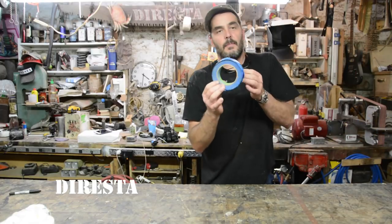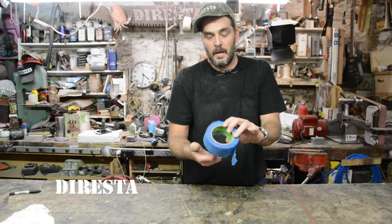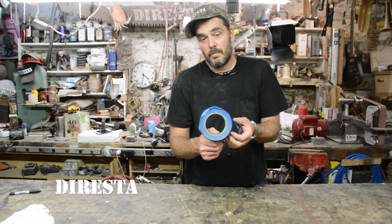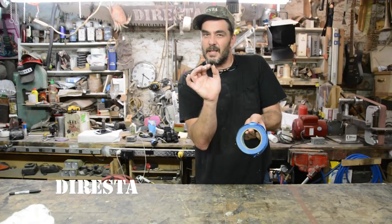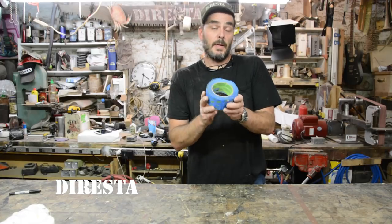And there, I have my flexible story stick that shows me exactly where things are. Now, some of you trolls might say that the tape stretches, and that might be true. But when you build things to install, you have to compensate for inaccuracies, so everything has a little bit more than it needs. So this has worked for me several times. Maybe it'll work for you.